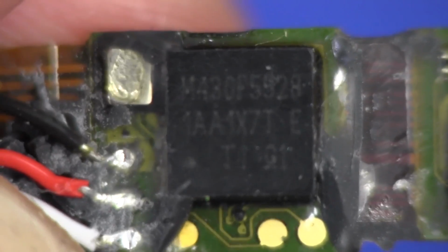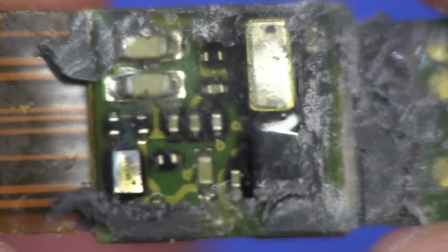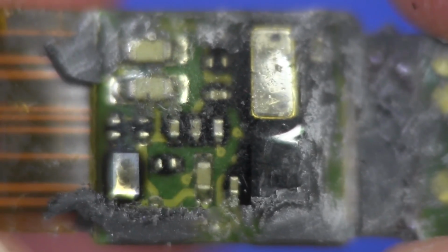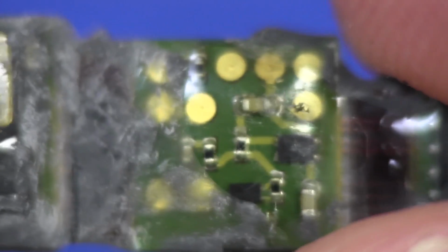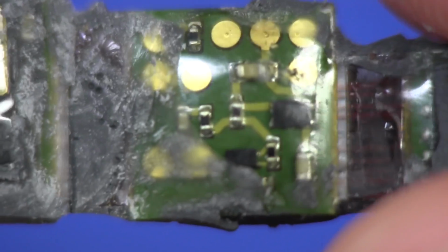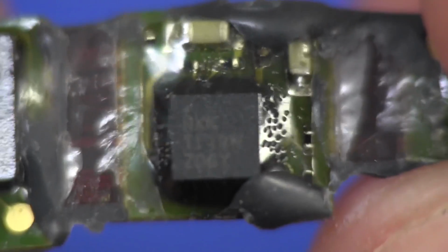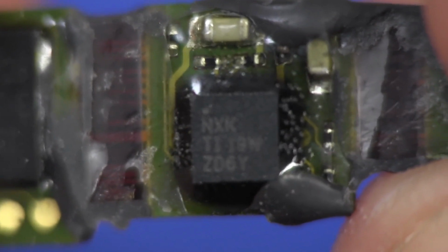The processor is on the top part. There you go, there's the MSP 430 again, and these really would be a pain in the ass to assemble, and you would have to go to a specialist rigid flex assembler who really knows what they're doing and can design all the custom jigs to actually hold all these in place while they're assembled, and really is tricky business, not something you would want to do willy-nilly, that's for sure. You'd want to have a very good reason, like, you know, this particular application here, which goes around a wristband.